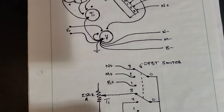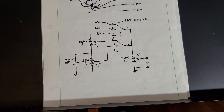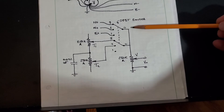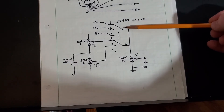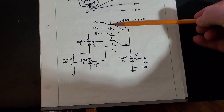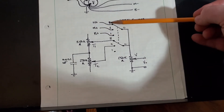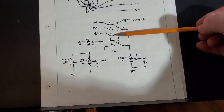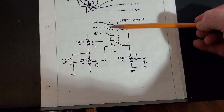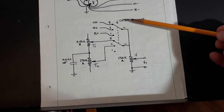Another way to think about this system is with a schematic. Looking at the functional schematic, we have a double-pole three-throw switch — two switches in parallel, each with a pole and a switching element that can go between three other poles. One side of the switch handles pickup selection: neck, middle, or bridge. Since this is a five-way switch, you can also cross between positions to get neck-and-middle, or middle-and-bridge combinations. So it's really a three-way switch with two poles acting as a five-position switch.